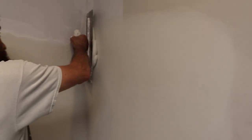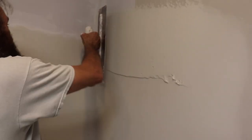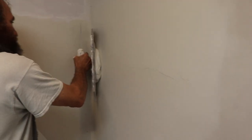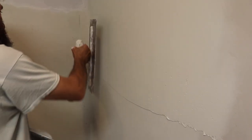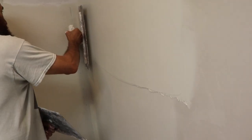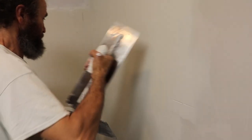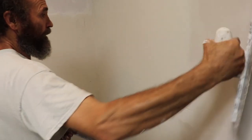Yes, I have the skim there. Here I'm gonna do the finish coat on it, so I'm just gonna load it good. The mud is a little bit hard — just the way I like it for this type of job, because when we do this it's on top of fresh concrete, so we need the mud to be a little bit harder than if we're doing a new job. So we just load it, we just run the trowel. Now this time we just leave just a little bit of compound on top of the skim.